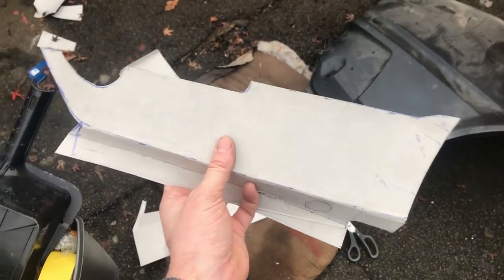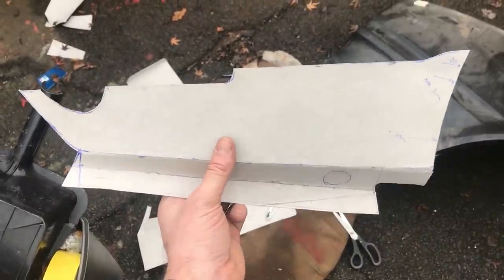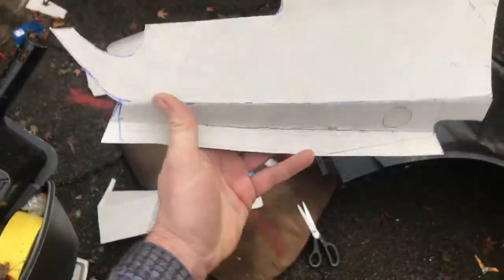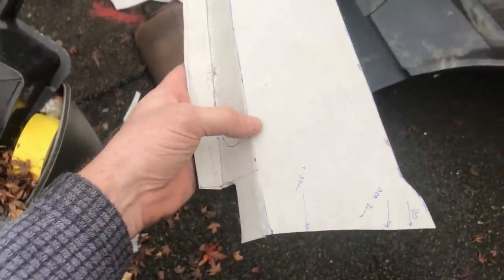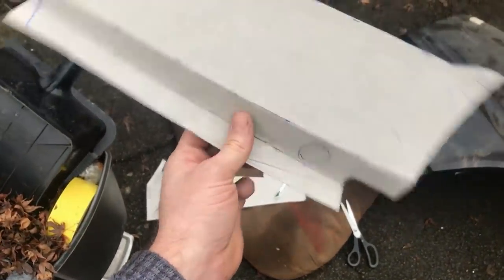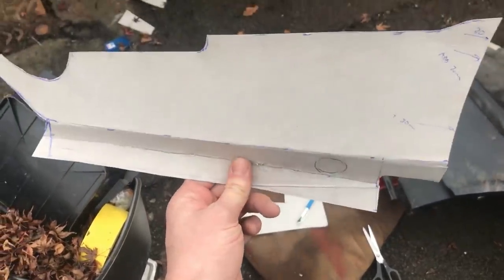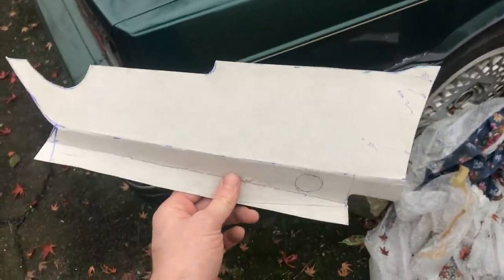But I'll go and get the folder out. I'll cut the piece the right shape. Then I'll either fold it in the folder if I can, or I might have to bend it over the edge of the workbench just so as I bend it up, I can put the return in. And I'll do this bend here first, because that's the most important one. This bit I can hammer and smash afterwards, and I can put a bit of belly in that by stretching this bit with a hammer, as you do, which I shall show later on, hopefully, if I need to do it that way anyway. Right, off to get the metal out, sheet metal, make noise and make mess.